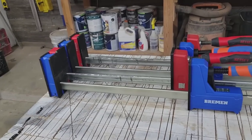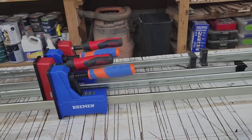Overall, I think these clamps are pretty good. At first I didn't think there was going to be any way to tell the difference between the two other than maybe the color. But as I looked more closely, there were definitely a few differences. The main telltale sign of them being from Harbor Freight is that fixed end having that discrepancy and not being a true 90 degrees. For some of you that's going to be a deal breaker, and that's OK — you know the type of woodworking you're doing. I do a lot of DIY type stuff as well, and for me I think these are going to work. I'll probably continue to buy more. If this has helped you out, be sure to hit that like button, consider subscribing, and leave questions in the comments.